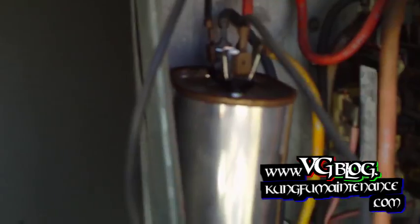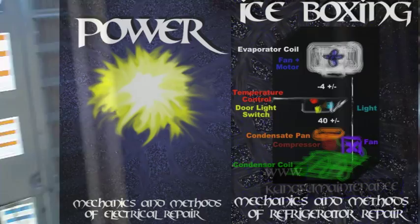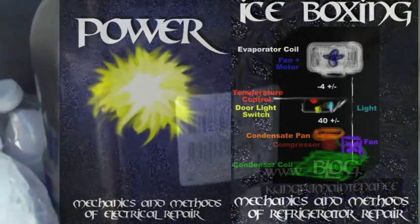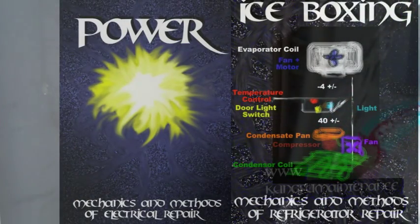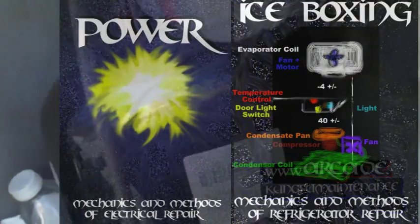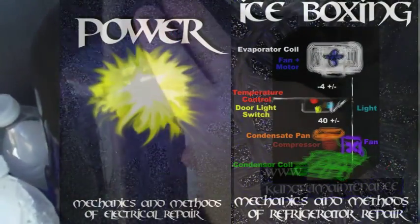It could be a bad capacitor for the compressor, a shorted compressor, burned wiring, or a bad contactor. The capacitor does look a little bit tired, and the hard start kit looks a little tired too. But I think it's just the overheated compressor — it does feel hot to the touch, and usually it doesn't get hot to the touch unless it's able to get power to it. We've got our new fan capacitor. I put some more water on the compressor. I think we're going to let it sit for about 15 minutes, but I really want to see if the fan motor itself is going to start with the new capacitor. So I'm going to plug the disconnect — if the fan starts but the compressor doesn't kick on, I'll disconnect it again and let the compressor cool down.